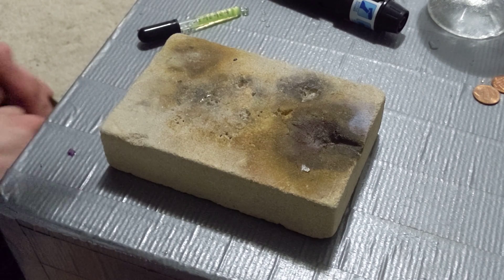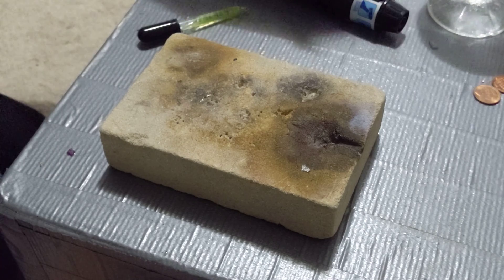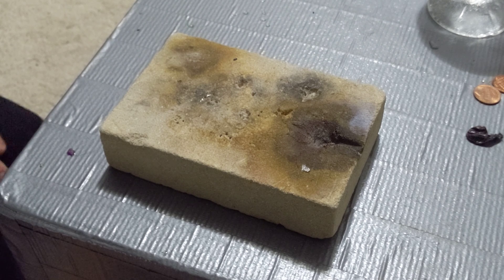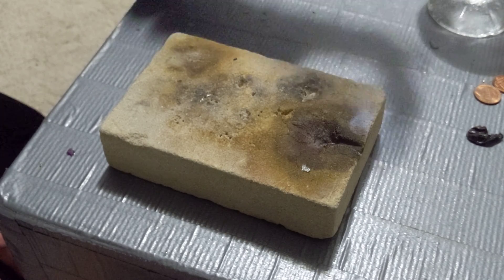For medium silver solder, you need a composition of 73% silver, 20% copper, and 7% zinc. I'm not going to be making medium silver right now — it's pretty simple. It's the exact same method: you just mix the three metals in that ratio — 73% silver, 20% copper, and 7% zinc. I will make some hard solder though, so we have our easy solder here.